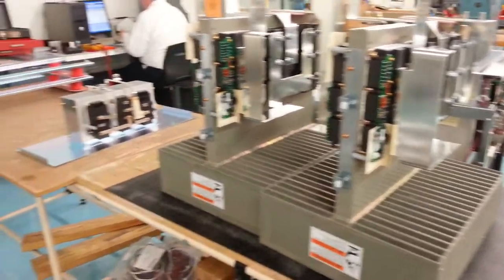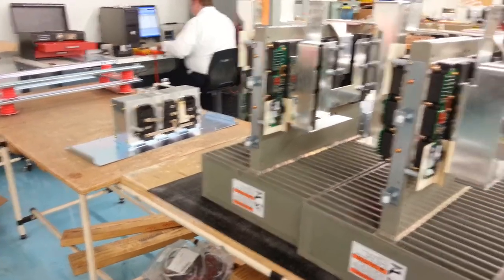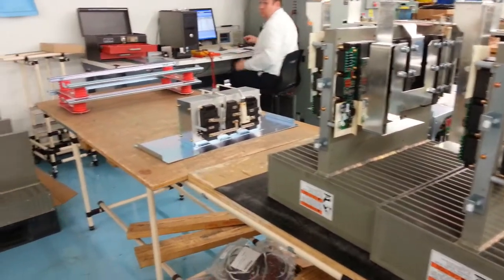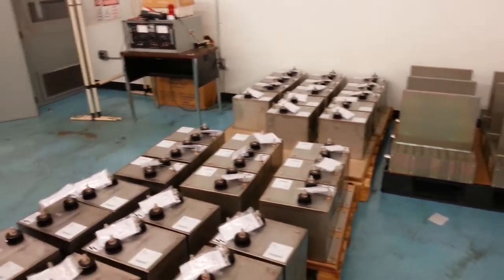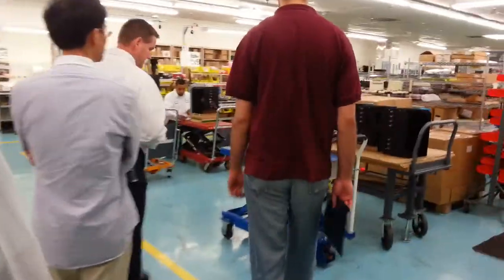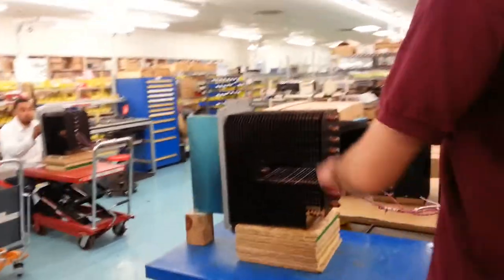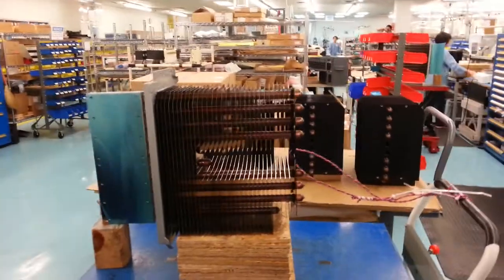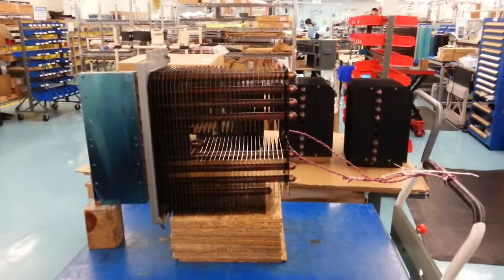There's actually large copper tubes inside there. Copper is a good conductor of heat — there's actually a light oil fill in there. It helps wick heat to the copper, then the copper transitions it to the heat sink, which the air flow gets rid of. Here's those heat sinks where you can see the copper rods — these are used actually for subway cars, for our transportation drives. These large assemblies clip into the bottom of New York City Transit Authority's railway systems.